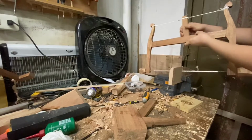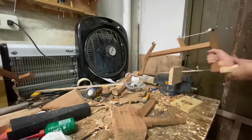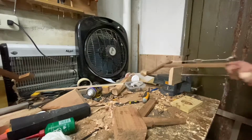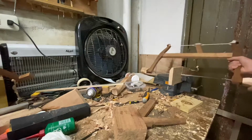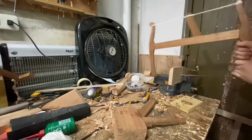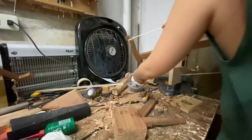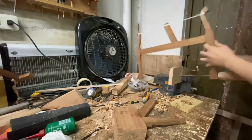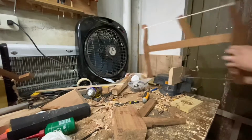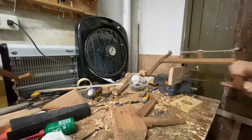So this is the first time of me using this thing, and at first I thought the tension was too loose, but I was overestimating how tight curves a 1/4 inch blade can cut. But even though it can't cut the tightest curves, it could still come in handy. So yeah, it's just me getting used to this thing because I never used it before. And I'm just cutting a semicircle on a scrap board. Why do I keep saying random words today?